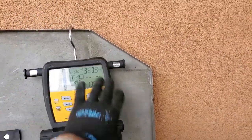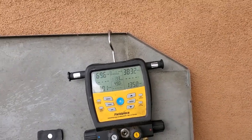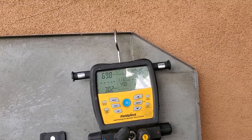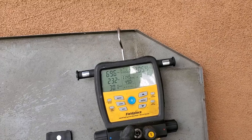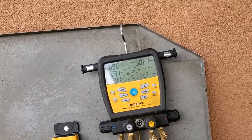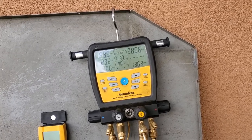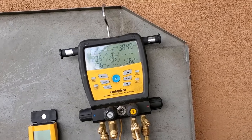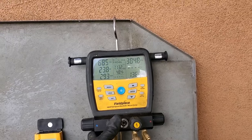And what I'm gonna do is adjust the defrost so the defrost doesn't happen as long of a duration, so the box temp doesn't get so high. The fear is that coming out of defrost, because that's kind of like a hybrid freezer, they only get it down to 20 degrees. And it still does electric defrost. So the fear is that with the electric defrost, the box temp is gonna get too high. Unlike the beer walk-in that I did a while back, where they maintain 35. This one, they actually maintain 20 degrees. So there's a legit reason to have a freezer coil.